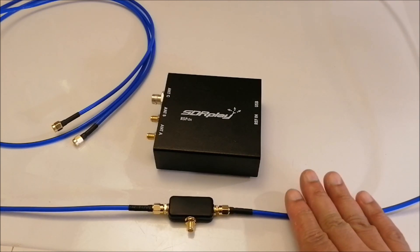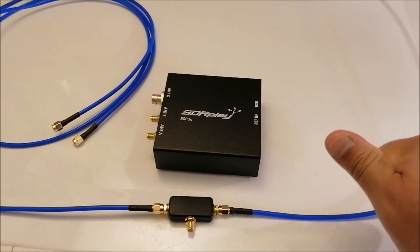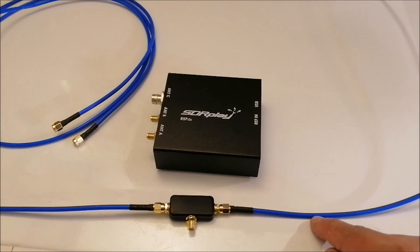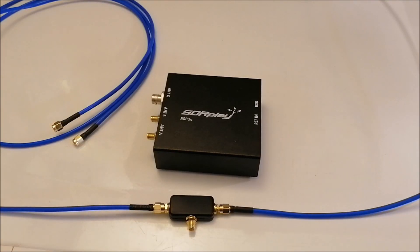The reason I purchased this antenna is to try out the long wave band. I'm very happy with the MLA-30, MLA-30 Plus, and MFJ-1886 loop for medium wave and long wave — this is not a replacement for those. The problem is those amplified antennas have a raised noise floor going down to long wave, and borderline signals get buried under electronic noise from USB or other interference. Amplified antennas, unless you have something like a Wellbrook, are going to have issues on long wave.